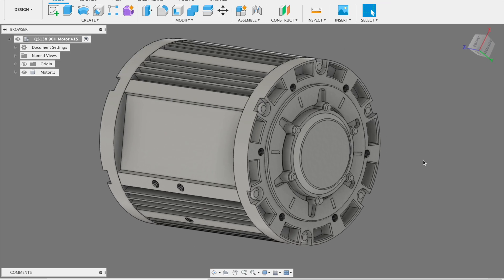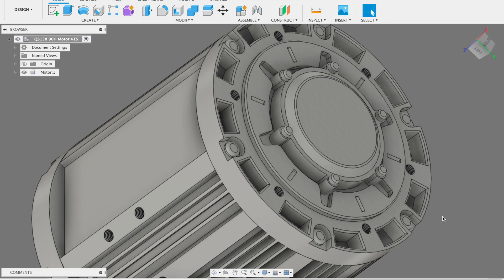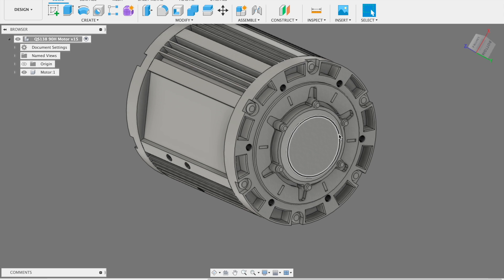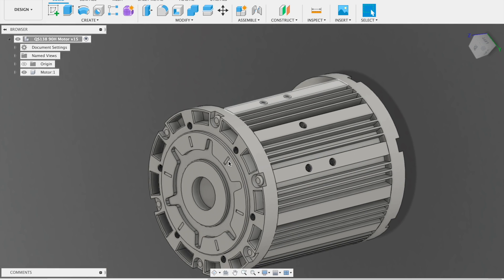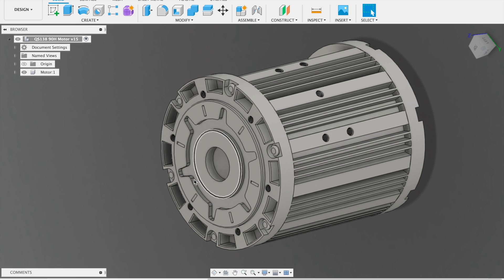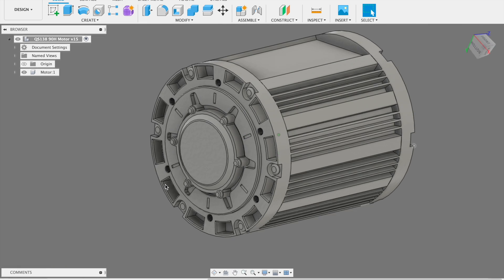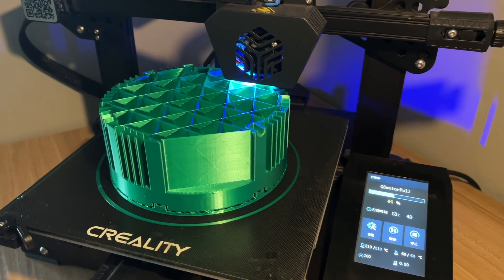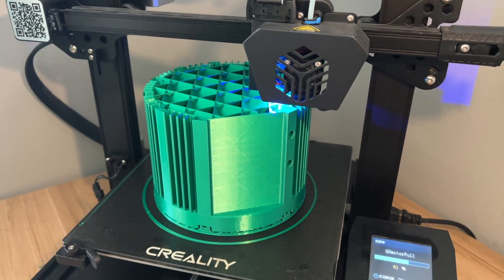Here is the finished model. I modeled a lot of the fine features — I really didn't need to, I could have just had a more crude representation, but I figured let me actually try to make it cool and go all the way. I even modeled the screws and all the different little features and indents, so this is pretty much a perfect model of the QS motor. The one thing I didn't model here is the shaft, because I'm going to put a bearing in there and 3D print a shaft separately so it'll actually spin. That humming in the background is the 3D printer printing it as we speak — it's about a day and 13 hour print and takes about 800 grams of filament.